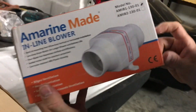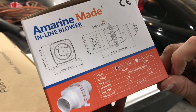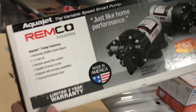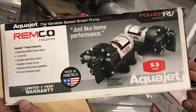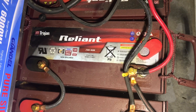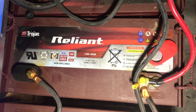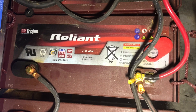These are the little 12-volt blower motor fans we're using as inline exhaust fans — you can also get them in 24-volt. This is our water pump that feeds the whole house from our water catchment tank, and it doesn't use much power. These are the batteries we went with — the guys said they were having really good luck with them, they're pretty affordable, and they're working really well. They're 12-volt batteries linked together in series for 24 volts, and we have eight of them in total.